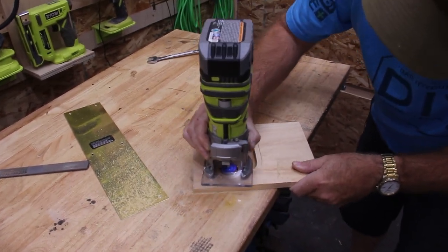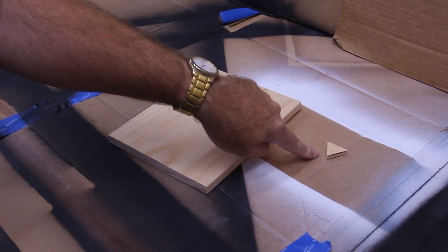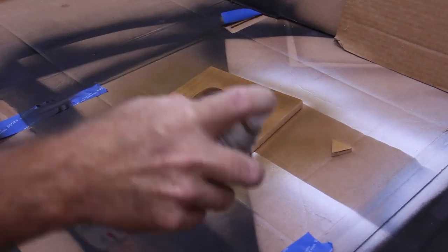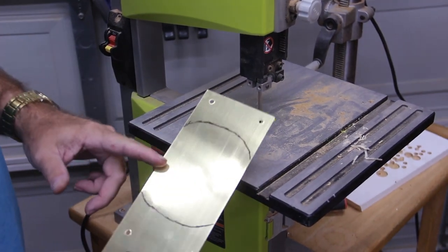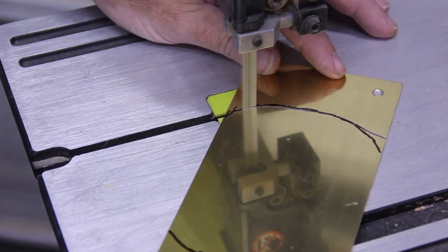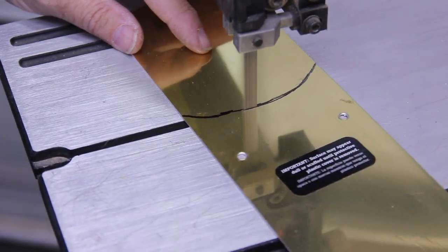On the backside, I need to cut a rabbet around the back of this to hold the brass plate, and I need to cut a keyhole — I'll do that with a router. So I got everything sanded down to 220, and off camera I made the little play button arrow and I'm going to paint it bronze metallic with this Rust-Oleum right here. While I'm waiting for the paint to dry, I'm going to rough cut the back insert — an aluminum sheet with a brass covering — on the bandsaw. You can cut aluminum on woodworking tools, then refine the shape on the bench sander.